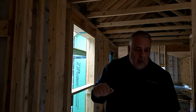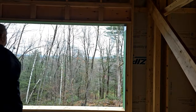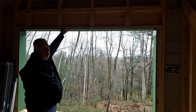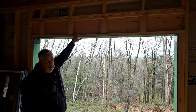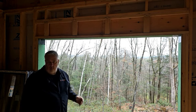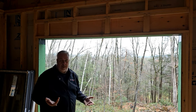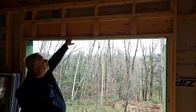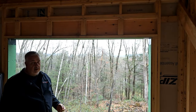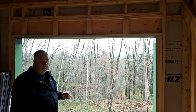If I go over here and look at one of the bigger walls — the little windows — this thing's probably on the order of about eight feet. You notice it's a little shallower here. The reason it's shallower is because I had to do a two-ply LVL for this because of the length of the window. Basically, the header is nothing more than a beam — the larger the span, the thicker or bigger the beam has to get. We could have potentially moved to a single-ply and taken it all the way up to the top plate with an 11⅞ or 14-inch single-ply LVL, and then we would have been in that same situation as before.